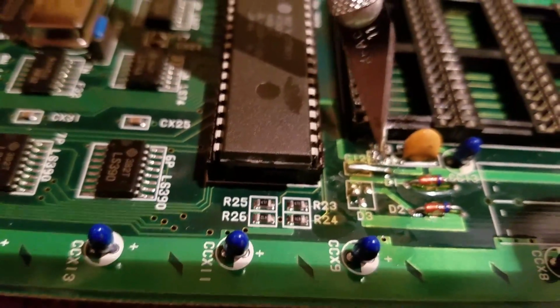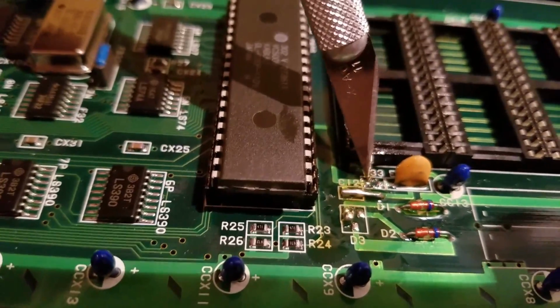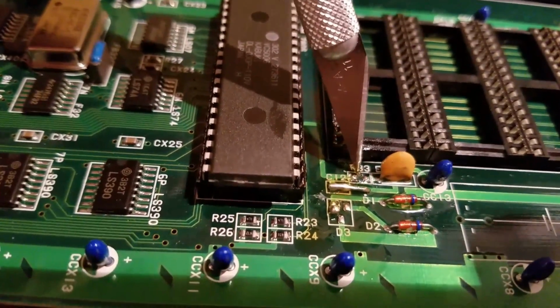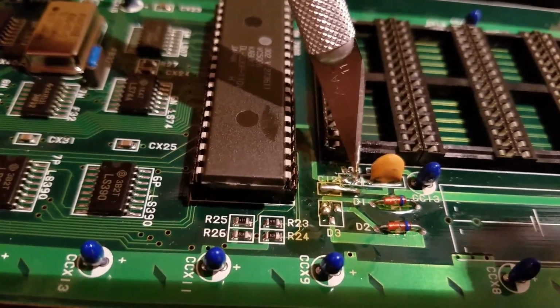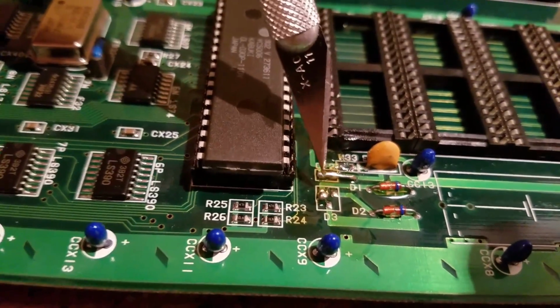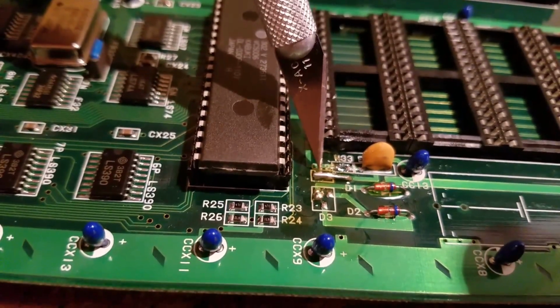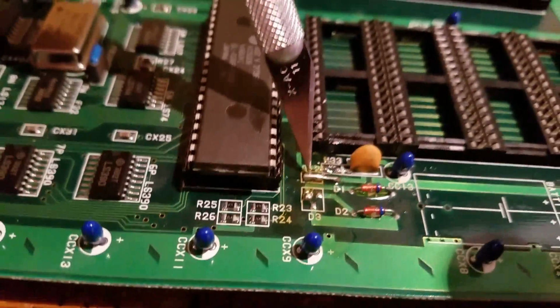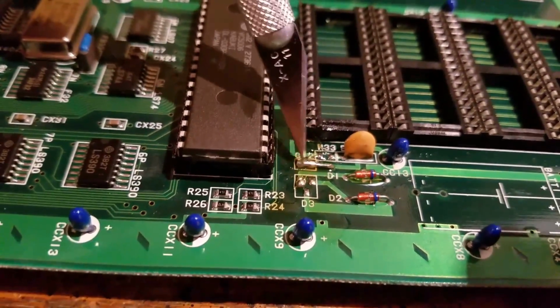Again, that flux I'm going to clean out of here. There's a resistor right here. It's very similar to one of these here. So this R33, you have to remove that out of there, alright? And just leave that open. And then also there's a capacitor here where that C12 is. C12, what you want to do is remove that capacitor out of there.